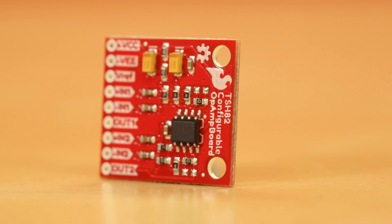We've also left you a free footprint in the feedback path of both stages so that you can add a resistor to reduce gain for greater bandwidth, or add a cap to reduce bandwidth and noise. This is a really great board for all your audio projects — it'll cover all the lower ham frequencies, so if you want to do some gain staging in one of those bands, this thing is really awesome. Go check it out today.